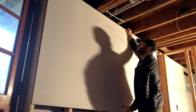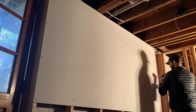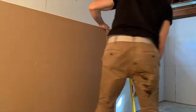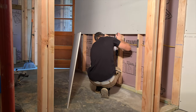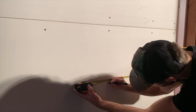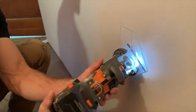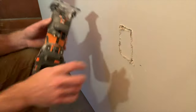After cutting that piece of drywall to the correct length, I installed it every 16 inches on center maximum, with eight inches on center as the minimum spacing. Here I am cutting the bottom piece, scribing it, cutting along the line of paper, and then putting it in place. What I'm doing here is drawing the location of the outlet box — I usually just write that on the piece of drywall. Then I installed it in place, took the measurement, and transcribed the bottom right corner of where I can find that electrical box. I'll scribe around a spare electrical box to get a general idea, and then use a router or roto zip to go counterclockwise around the box that I marked.